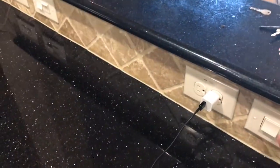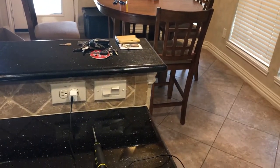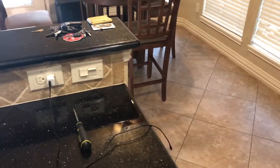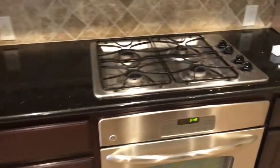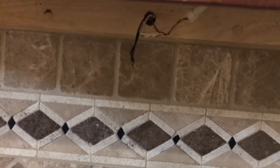So first we're gonna turn that off. And I know normally you'd go to the breaker box and turn it off, you'd be much safer than I'm being. There's nobody else at home. I don't have a good way to lock that out, but there's nobody else home, so I shouldn't be in much danger here. And I have tested that these wires do indeed go off when I turn that switch off,